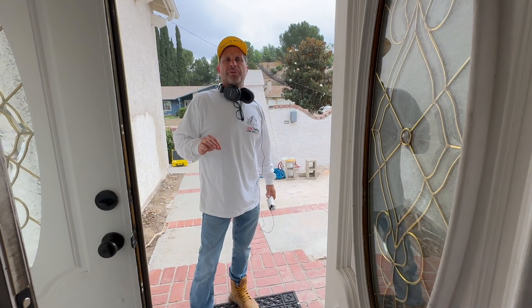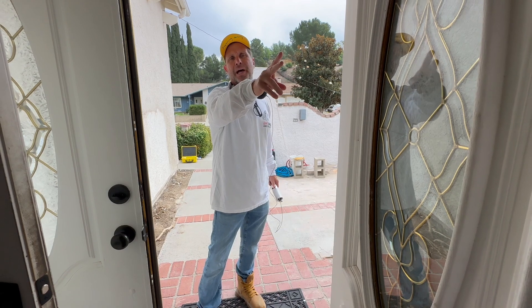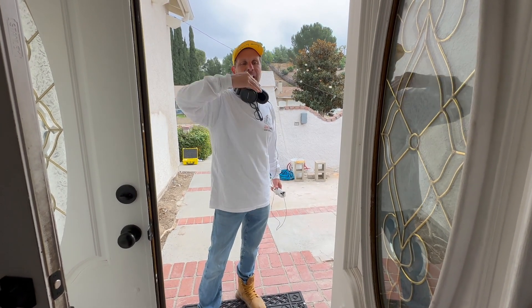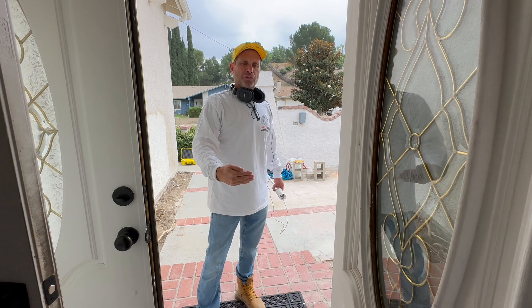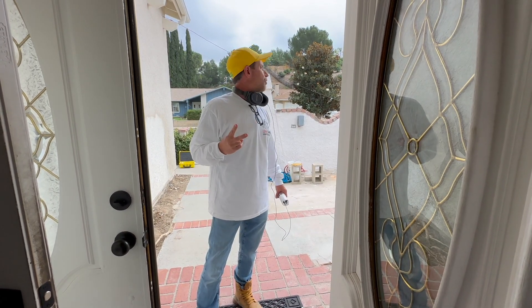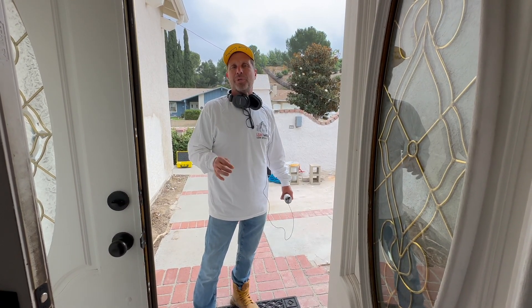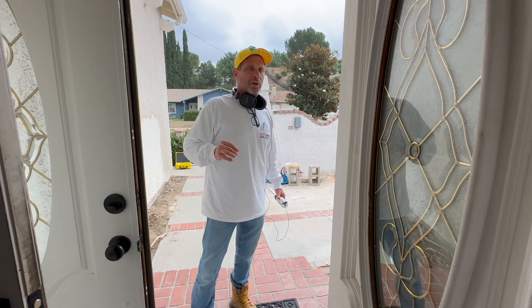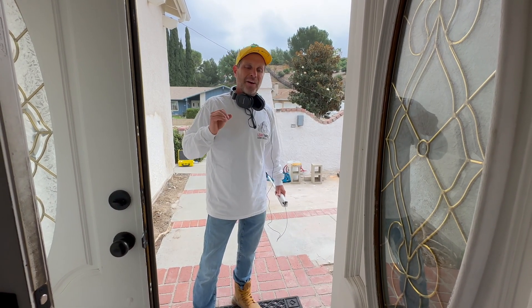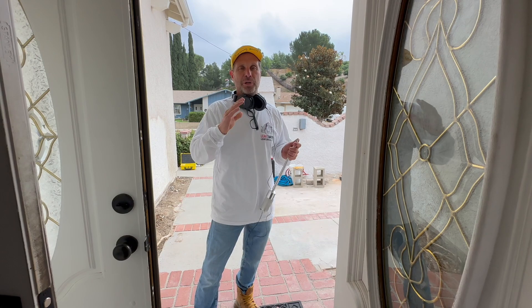Walking the whole house, I didn't get much transfer noise elsewhere. I first listened to the sink in that guest bathroom — it was somewhat loud. I touched the angle stop of the toilet — really loud. There's plumbing right on the other side of that wall. I know my leak is going to be somewhere under the slab in that general area. Now we go to Part 2: we're going to hook up to the cold water side at the most convenient place, probably a hose bib, shut the house down, inject air, and listen with our disc to put ourselves right over the leak.